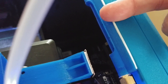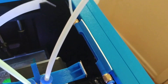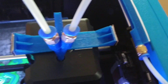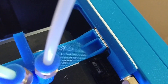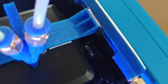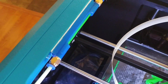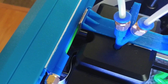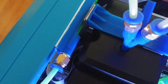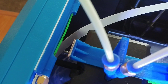And once it gets back out far enough, it can no longer push it any further. You can see mechanically it's pulling it out using the friction pads. So now that it's pulled the blue out, I'm going to come over here to the green. And there it's loaded the filament and now it'll go ahead and extrude a little pile here.